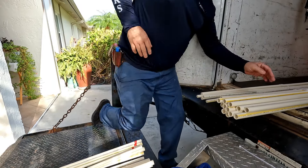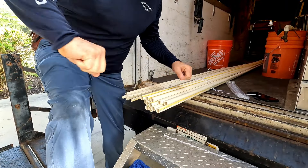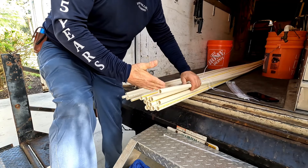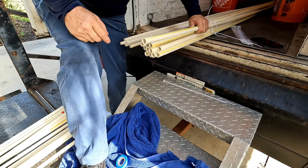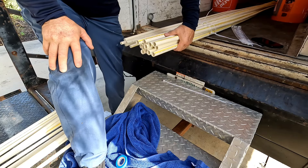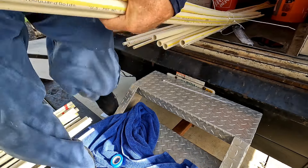Here's a little tech tip: if you want to glue all your stuff together and push it across the attic, if you take this and glue a 45 on it with a little piece of pipe, it's very hard sometimes to push a straight pipe through the attic. But if you put a piece of pipe on it, you can rotate it and it'll ride up over any construction. I don't need to do that on this job - I'm going to have Sean downstairs and I'll stack this stuff up at the access.